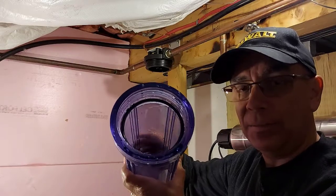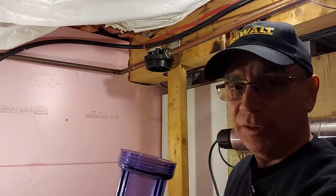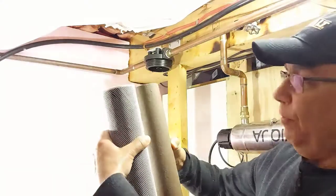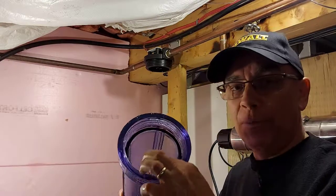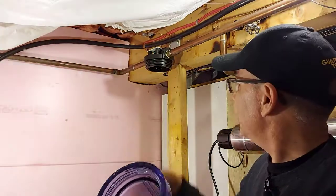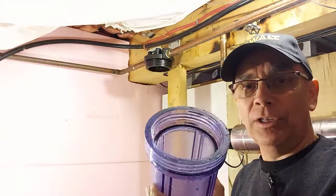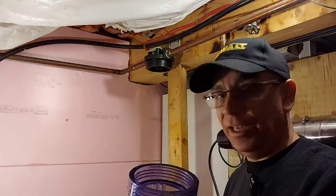Now I'm going to wash this out — there is some sediment in the bottom, so I'll wash and rinse all this out before we put the filter back in. The filter here is kind of dirty. I have a replacement right here. While you're taking this off, note there's a rubber seal — an O-ring — that may be stuck up in the housing. When you empty the water out of your cartridge holder, make sure you don't lose that O-ring. You're going to need it.